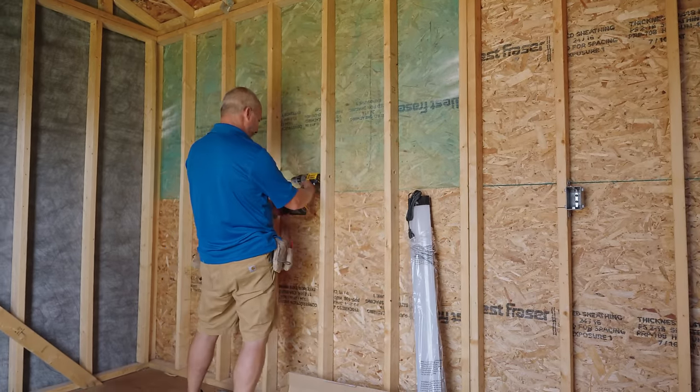So now we've got our power coming in on the black. Black goes to the switch, at the bottom of the switch. When we flick on the switch, the white wire, which has got tape on it, comes over here and becomes a black wire, providing the power. And then the neutral, to complete the circuit, goes back to the panel from here. That's as easy as I can explain it.